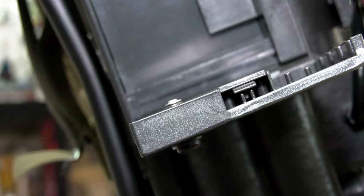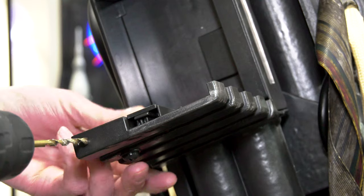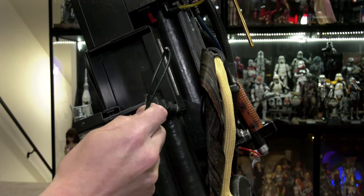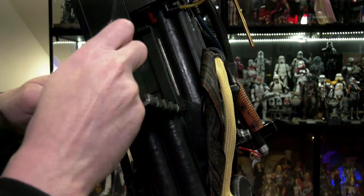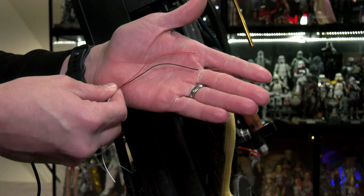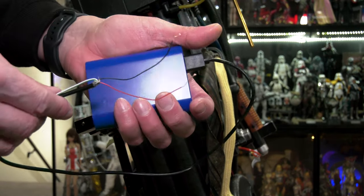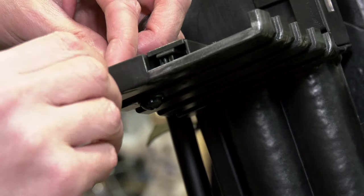This is the top lid right there — I'm just going to drill through it. I did off-camera power tests because four size D batteries pump out six volts, but I had a suspicion it's regulated down to five volts. So the four batteries only require five volts. I stripped the micro USB and got the positive and negative — red and black wires. This proton pack works at a minimum of five volts just fine.